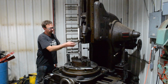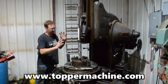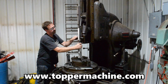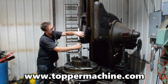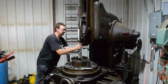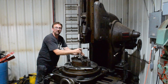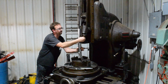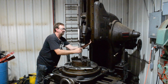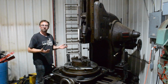Well, there you have it, the shop-made slotter toolbar. Now, the slotter is set up pretty nice, how you can adjust your left to right with these screws here. And the way I made this bar is so I can use it on a longer stroke if I need to. Just raise it, lower it. This is a multi-purpose bar. So, should work well for this job.